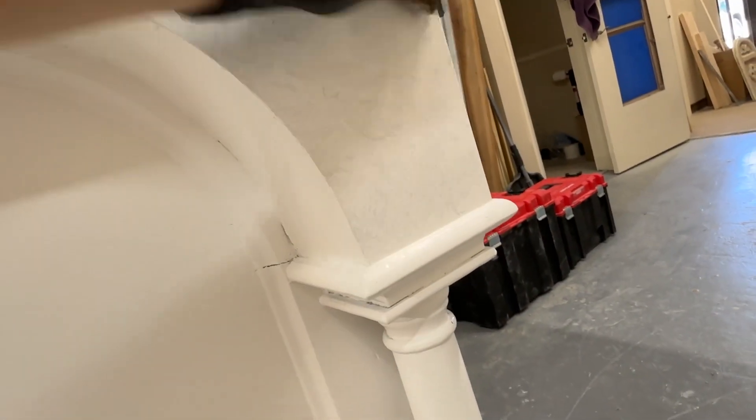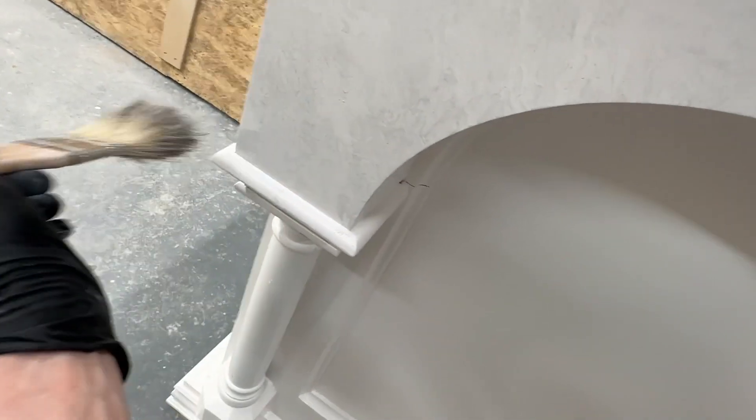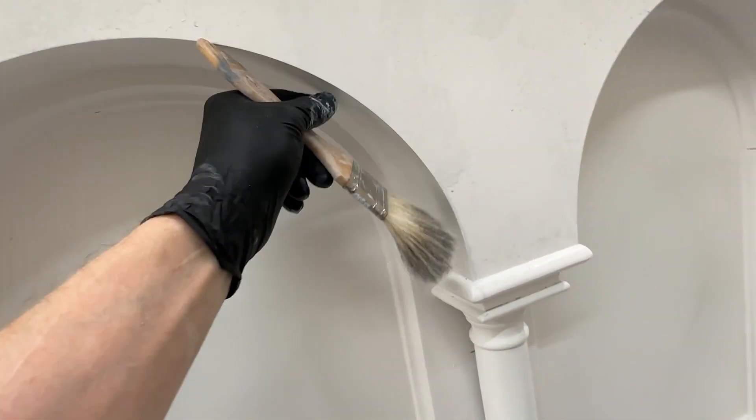We're starting to dry here. I'm in here with a brush — a very fluffy brush that I've kind of trained. What I'm doing is going to soften it even further. Not everywhere — because this is marble. It should never be uniform in appearance and it should never be symmetrical, because that's just not possible with marble given the way marble is formed. Try to get little brush hairs out immediately, get those bristles out. I hope you guys can see what's going on — got such a beautiful marble effect going on right here. I only want to soften it up very slightly, just taking some of the hardness out of it.